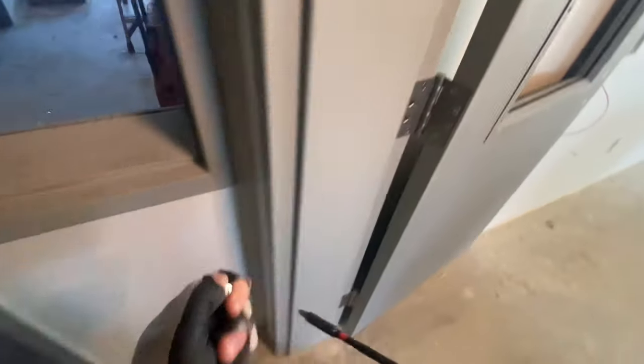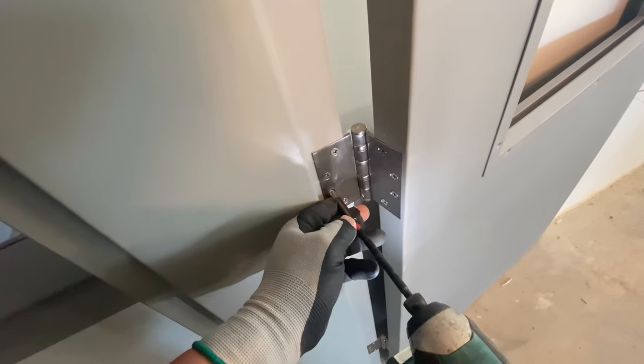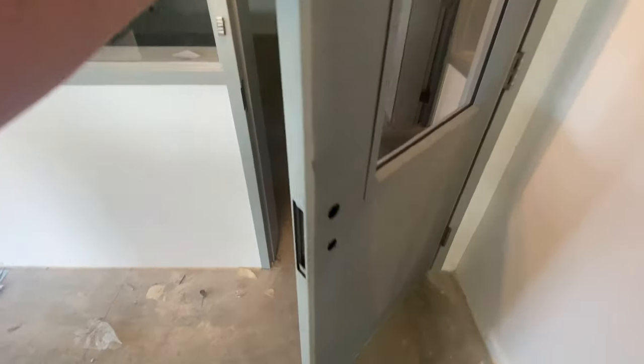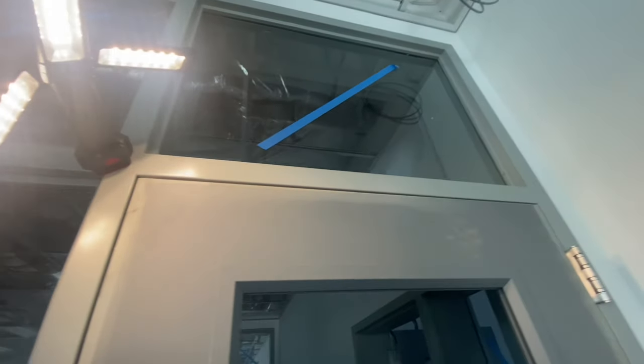Let me quickly cover the pros and cons of this method. The pro is I have maximum adjustability by putting the shim in the middle. The con is that later on, if this door gets serviced by someone who doesn't know why I put the shims in the middle and they just screw it in without thinking about which screws to tighten first, that could be a problem — the door is going to start hitting that latch leg again. That's one negative of shimming in the middle, but I love it because it really lets me dial these doors in.